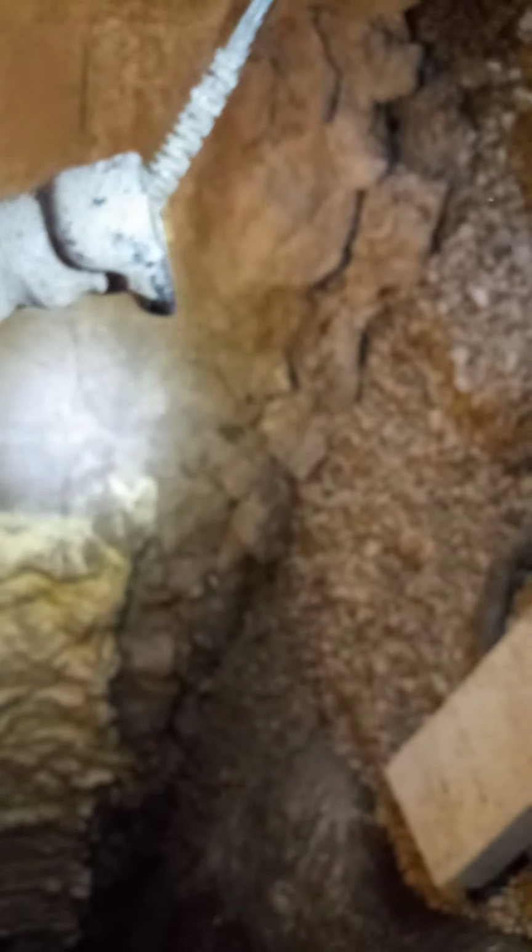What happened was all this plumbing right here was all broken up and it was no good. I had it originally coming from the corner of the house over here, and then it would come down into here and then over and out, and it actually went underneath the neighbor's property, underneath the next neighbor's driveway, and all the way down to the corner. Old 120-year-old clay sewer pipe, and this cast iron here was all rotted away. It was a huge mess.